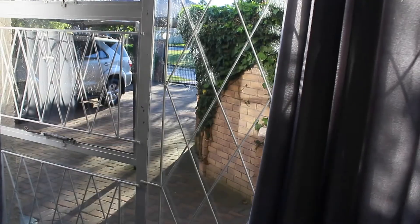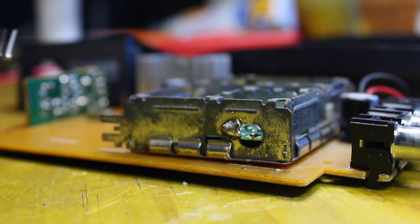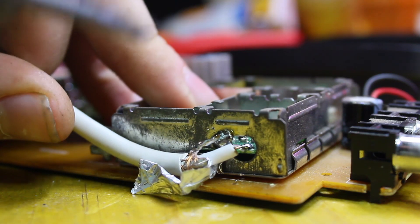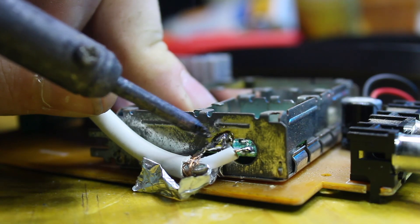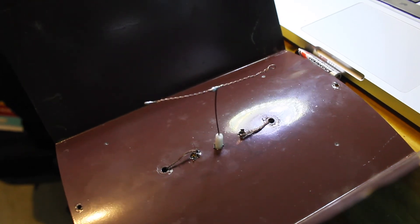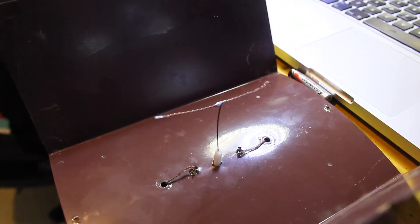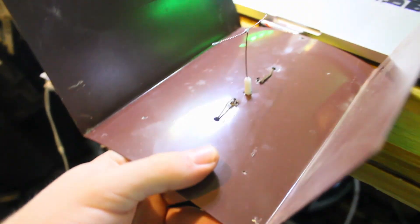My idea is to move the receiver and the antenna to the next room. Down there is the antenna of the camera, and it will have a much more direct path to the receiver sitting on the windowsill here. At that point I moved immediately across to that room and still had terrible signal. So I decided to experiment with different antennas. Tried a Wi-Fi antenna — terrible. Tried a television RF antenna with coaxial cable — no good. Then I tried to take inspiration from the original antenna, which had a massive grounded area and a very small section dedicated to picking up the main signal — a massive metal plate with a small piece of wire in the middle. But that was just like hanging a coaxial cable in the middle. The next thing I found was much better.